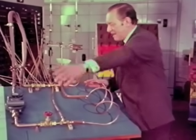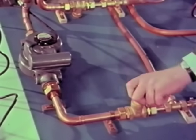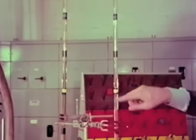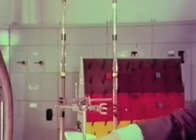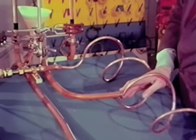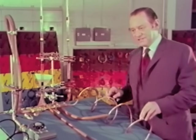In this circuit, the driving member is here — the pump. This is a valve or switch. When I open the valve, you will see a plunger rise in this tube here. This is recording the rate of flow of the water. Here is a manometer recording the pressure difference between two points in the circuit. The manometer is connected in here and in here so that it measures the pressure in this piece of pipe.